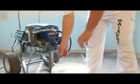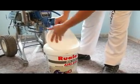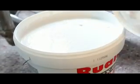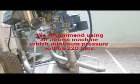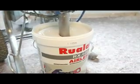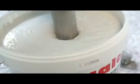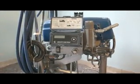Product application. The sprayable product RX-600 is supplied ready to use, so we just have to open the container and put it into the machine for its projection. We recommend using an airless machine, the minimum pressure of which will be 220 bars. Nozzles used in this shooting have been 5.29 and 5.31. If we want wider projection amplitude, we can use 6.29 or 6.31 nozzles.